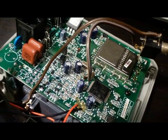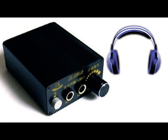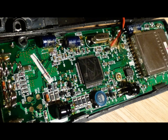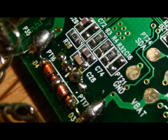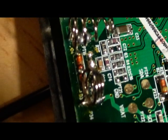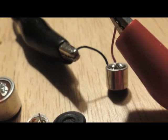Tack solder an audio jack to this point into a common ground connection. Hook the audio jack up to a suitable amplifier and a speaker or headphones, so you can monitor what's going on. Now, crack open the handset and find the small electret microphone on the PC board. Carefully remove the mic using a soldering iron and a solder removal tool. Add a length of shielded cable to these new clean connections. I had a few spare microphones lying around, so I tested a few until I got the best audio level.